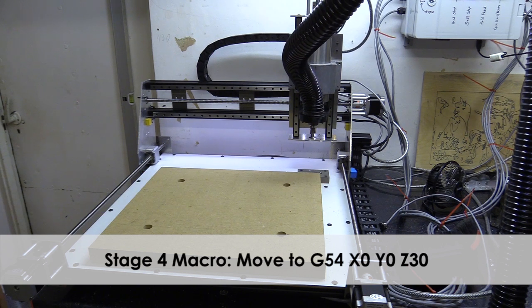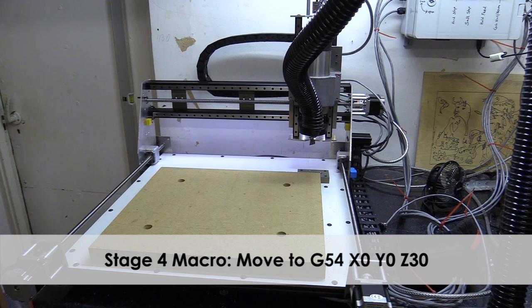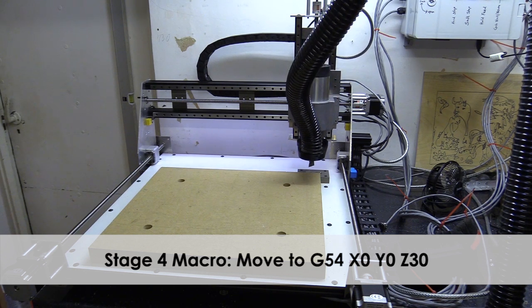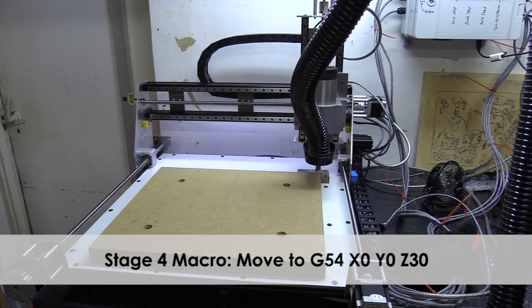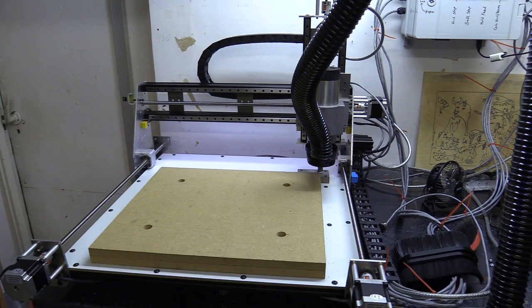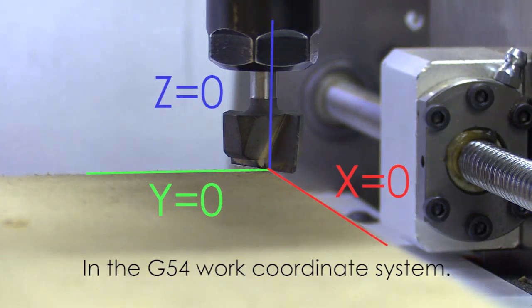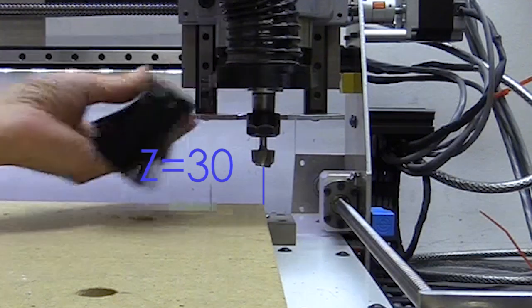The first moves the machine head over the probe location. The second probes the tool down in 2 stages to a stationary probe location. The third is used after the probing cycle and offsets the trigger location in the current work coordinate, so the tool tip Z coordinate is set to 0 when the bit is touching the wasteboard.